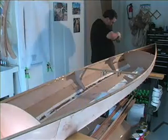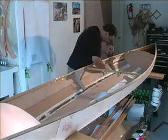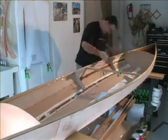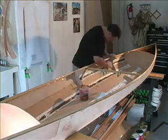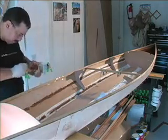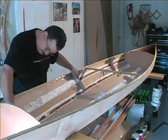This was the biggest section of the hull that I worked on so far, and it took quite a bit longer than I anticipated. I only ended up doing one side — actually the starboard side of the hull today. I laid down the fillet and overlaid the fiberglass tape that I had pre-cut before I started, embedded that in the thickened epoxy, and then wetted that down with the un-thickened epoxy to make a nice tight bond for the joints of the hull.